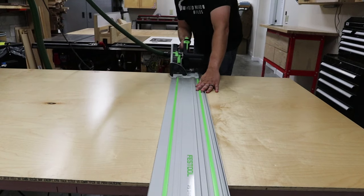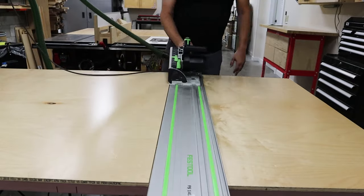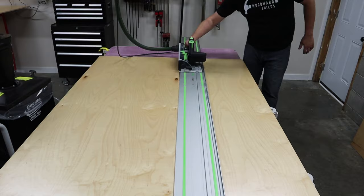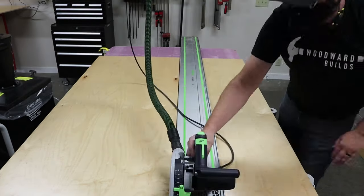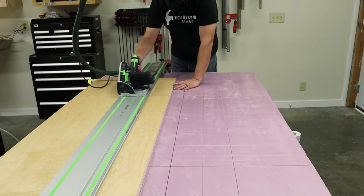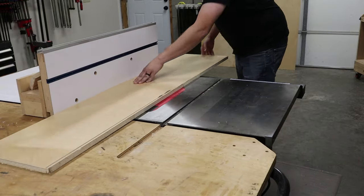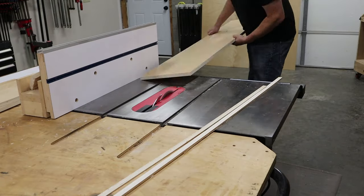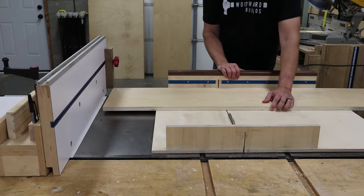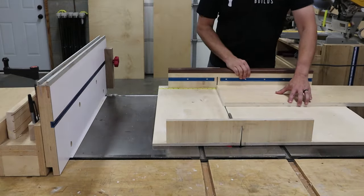The first thing I did was cut a section off the end of the plywood panel that I don't need for this project, so I'm just going to save that for later. I marked out and cut a strip for each side of the cabinet, as well as a third strip that I'm going to use for the top, bottom, and shelf. I then took my strips to the table saw and cut them to final width while at the same time removing the factory edge. I then used my new cross-cut sled to cut the top and bottom of the cabinet, as well as the shelf.